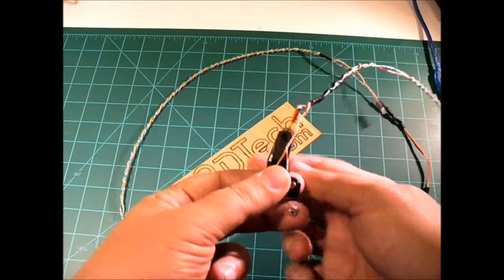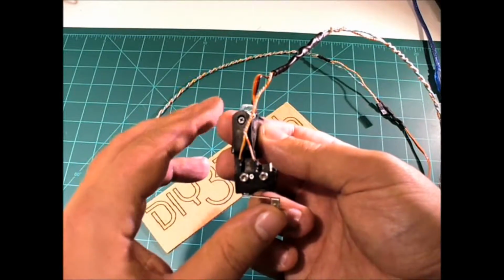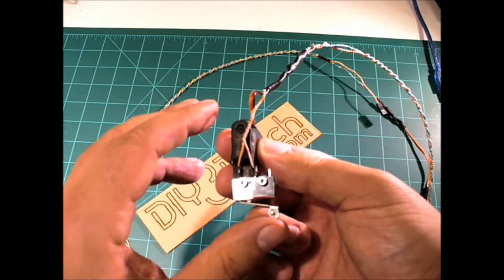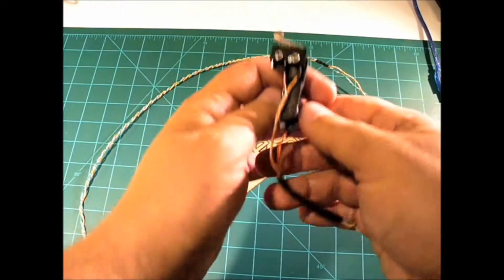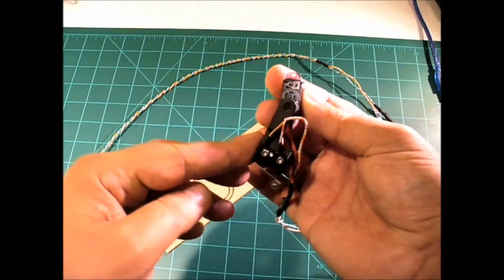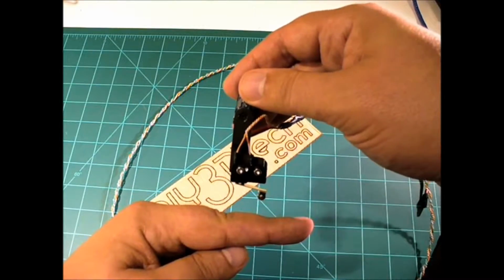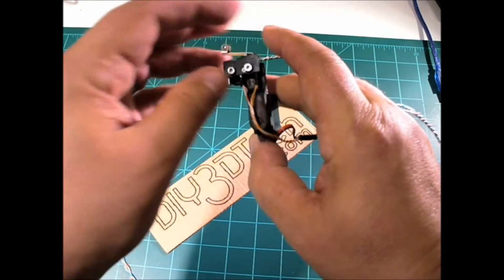So basically, we have the servo mechanism here, and we have the switch mounted on here. Now we're going to use a normally open contact, so when the switch goes closed, the contact's made, it knows it's come in contact with the bed. We got a little roller ball on here, so as the servo comes down, it will impact the bed. Actually, let's get the orientation correct. It'll sit in the head like this, and when the servo engages, it will turn down. This wire setup will actually be looped up. So it comes down, comes into contact with the bed, boom, the switch indicates the bed height, and then this will retract back upwards into the servo, and then it'll move on to the next.